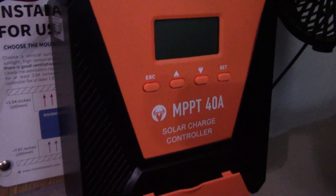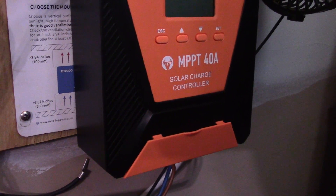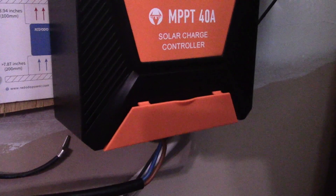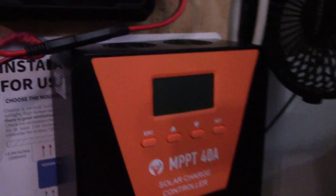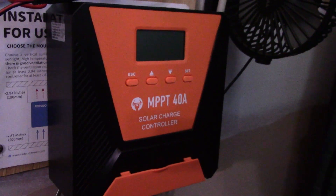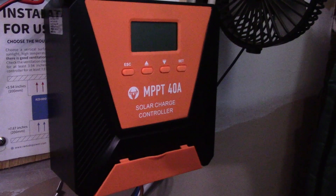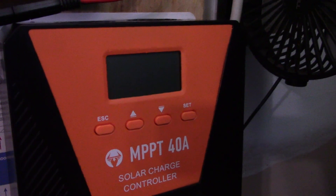Right, complete disaster. I was rushing a bit because the sun came out, and so I foolishly didn't check whether the blue or the brown was the positive. I should have used red and black — didn't have any more wire than this. These are a good gauge and I thought it was the sound of this plastic, but it wasn't. Evidently a fuse inside has popped. It doesn't have — well, not that it needs to have — reverse protection on the voltage.